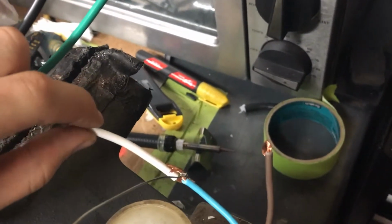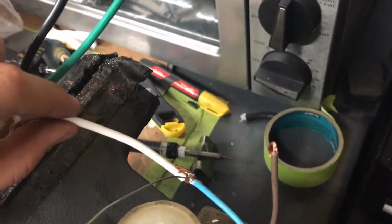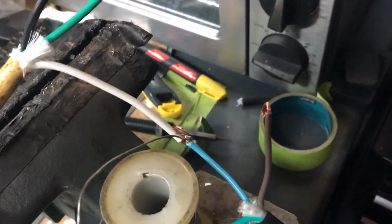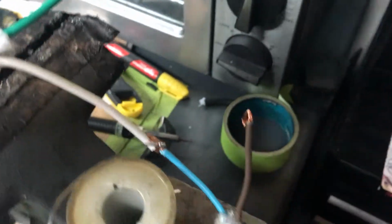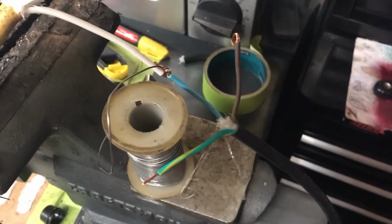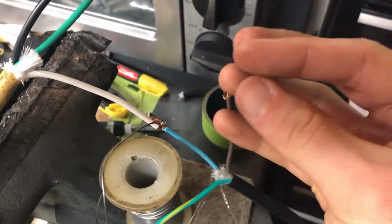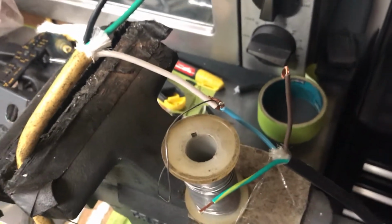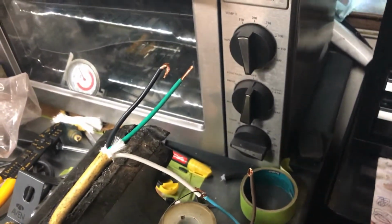Also, it's good practice to have some kind of shrink wrap around your wire before you do the solder, so that after you're done you can slide it over. But in this case I didn't have any shrink wrap that was big enough, so I'm going to do this the old-fashioned way and just put a lot of electrical tape over this after I'm done with the connection, and hopefully that'll be a decent fix. The better way to do this is to buy the appropriate diameter shrink wrap, and then you would use a lighter underneath it to get the shrink wrap to shrink, and you would have a very nice connection that was also protected. I hope this helps out you guys, and thanks for watching.